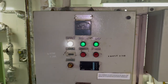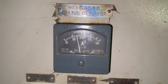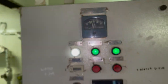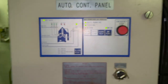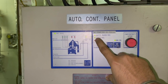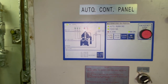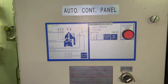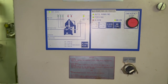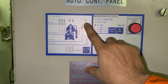This is the main dedicated control panel for this purifier. The amperage is around 14 amps for the number 1 HFO purifier. Always check the amperage on your rounds, as it is the first indication of whether the purifier is running properly. You will see indicators for auto running mode, feeding mode, and a red alarm LED, as well as a control safety mode. Always keep the MM (multi monitor) function on once the purifier is started — if it is off and the purifier starts leaking, you will get no alarm and all fuel oil will go into the sludge tank.